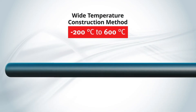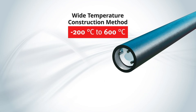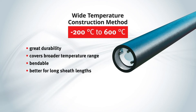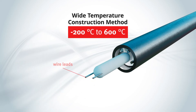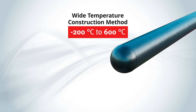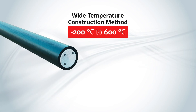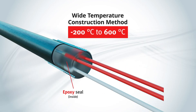Instead of using a tube and wires, high temperature constructions utilize a magnesium oxide sheath, where the wire and MGO powder are already packed in the tube. This construction has great durability, covers a broader temperature range, is bendable, and better for long sheath lengths. Part of the MGO powder is removed from one end to make a space for the RTD and to expose its lead wires for welding to the sensor wire leads. The end is packed with MGO, and a cap is then welded over the end for protection and stability. On the termination or transition end, once the conductors are exposed, flexible lead wires are attached. Then an epoxy seal is applied to prevent moisture ingress.